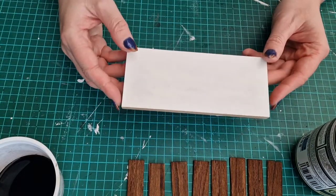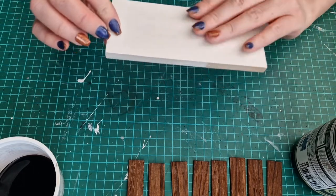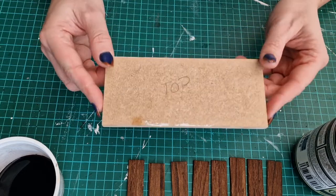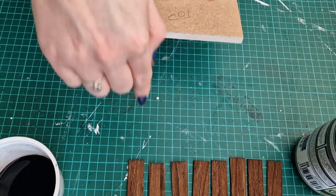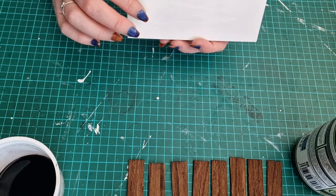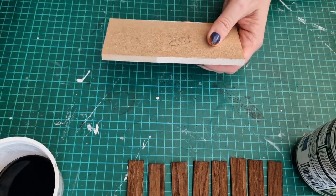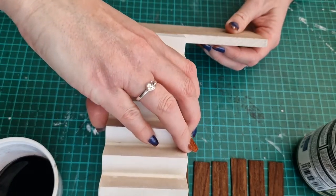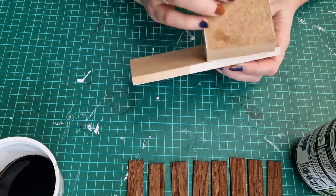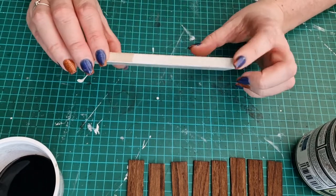This is the little stairway landing. It's been painted white and sanded three times between coats on the underside. You're not going to see that anyway because that's going to be just under there, with the stairs going up and round. I'm going to make probably a little stairs cupboard or something under there. So you're not really going to see that anyway, but because it's a ceiling I've painted it white. This edge has been sanded and painted. The other stairs going into this side - that underside part will need to be painted. This bit here is going to be white as well. I didn't realise that until after, which is why it's only got one coat, so I will have to give it another coat.